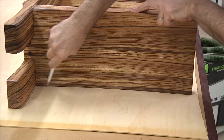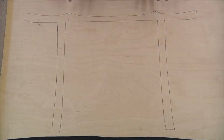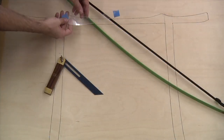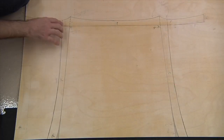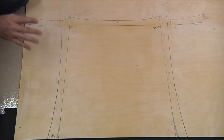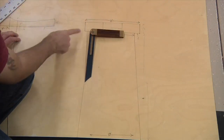I'm tracing the shape of an early prototype onto a sheet of quarter-inch plywood, and that'll serve as my starting point. From there, I can use various drawing tools to modify the design to my liking. Here's the new version — I refined the curves and added a three-degree slant to the legs. I also increased the width and added a taper.